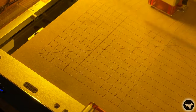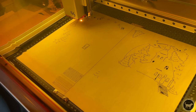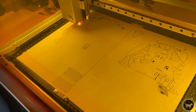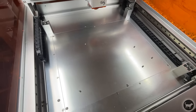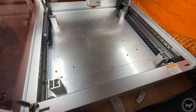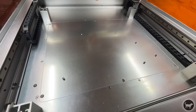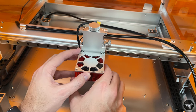On the last machine, I had added a spoil board to be able to use absolute coordinates, but now that it's built into the honeycomb, it's not needed. It also means that I could use absolute coordinates whether I'm cutting or engraving, which I've never been able to do before on any machine. Below the honeycomb, we can see the pegs for the rotary attachment that I'll touch on in a moment, but Rollie also added another wishlist item from my last review, and that is a removable base plate for the bottom of the machine. This means if you wanted to engrave an item too large to fit in the machine, you can remove that plate and engrave under it. The size is about 320mm by 410mm. It is also where you would use the laser module extension if you needed to be able to reach down much further with the machine.